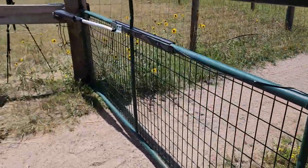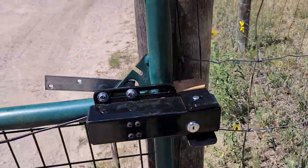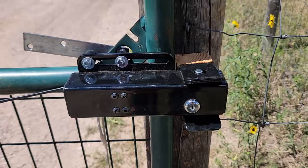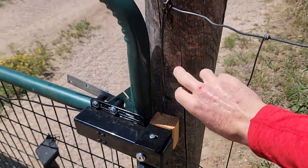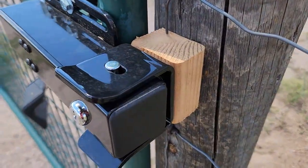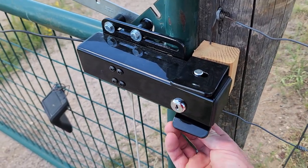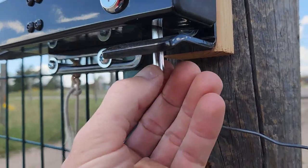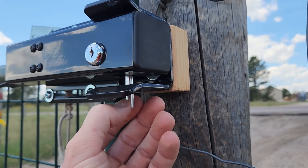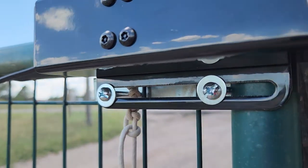It does need to be level with your gate top right over here. It's nice and level, and looks really good. I like it without the Mighty Mule logo — some people do spray paint that. Since I'm up against a post here, I actually had to add a little piece of wood drilled into my post. The pin slides around, so I think what I'm going to do is thread it and put a nut on it so it's nice and tight and not working its way around.